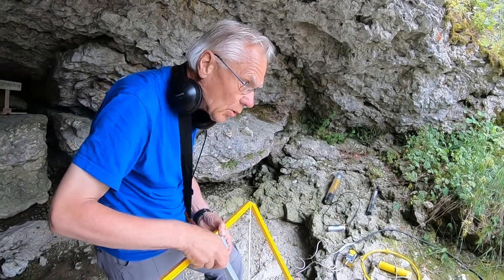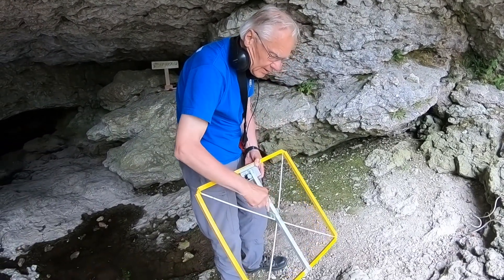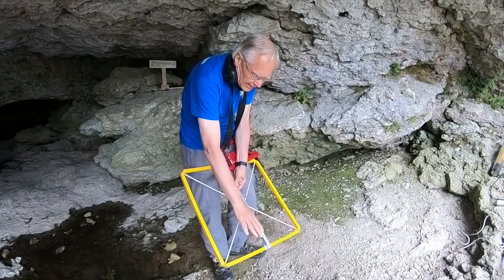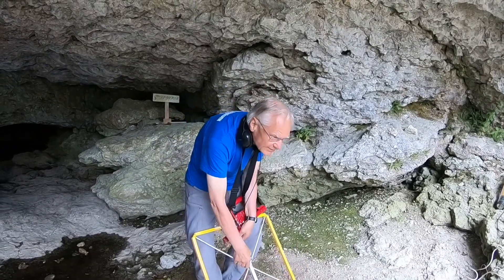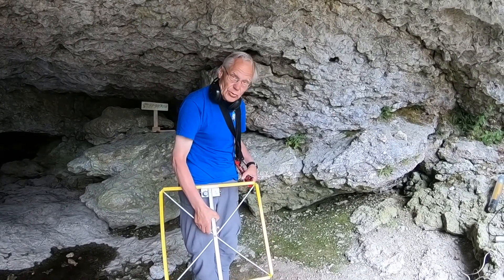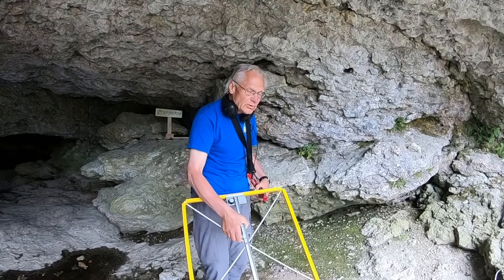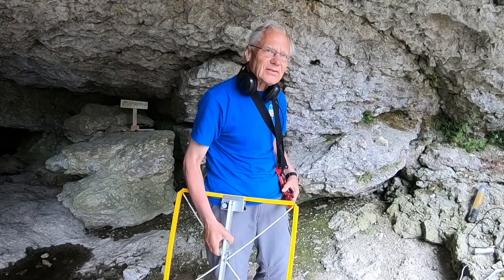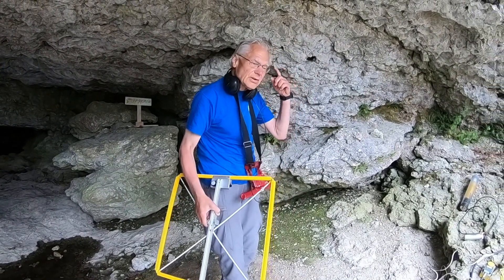Then I walk beside until I have the next level position — the bubble between the markings — and I've reached the position where the direction of the magnetic field is leaning 49.5 degrees. From that place to ground zero I measure with a measuring tape, take that measurement times two, and then I have the depth of the transmitter underground. It's very easy. You can of course measure at all angles and calculate, but it's rather complicated and not easy in a rainstorm, whereas taking times two — you can make it easy.